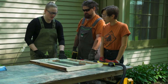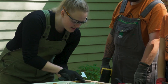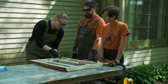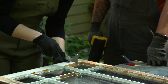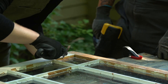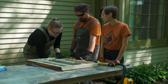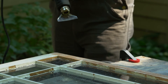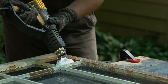We have the majority of the glazing out of this small pane. What we're trying to do now is slowly remove this piece of glass. The issue we're running into is that around the edges there's still a tiny bit of space that holds the glazing putty. So what we need to do is just soften that and remove enough so that we can pop this little pane of glass out. I'm pressing gently right along this edge with gentle wiggles to get it out. This edge is still very stuck, so I'm going to have you use the heat gun just barely along this edge where there's a little glazing.